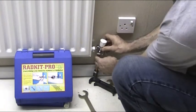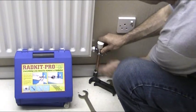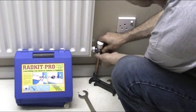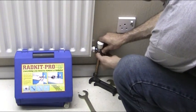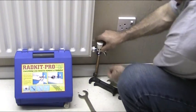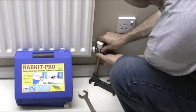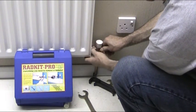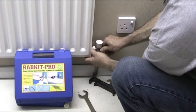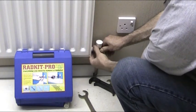Next, drop that over the inlet and pull the nut back up, screwing it finger tight onto the bottom of the valve. That means you've got some swivel — you can swivel it about. Then push the valve over to the union again and just screw the union nut back onto the valve. That's perfect.